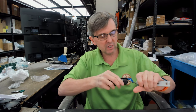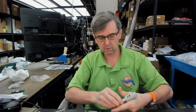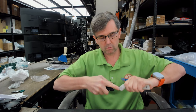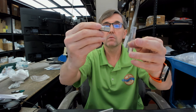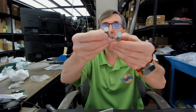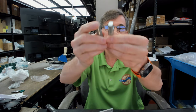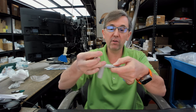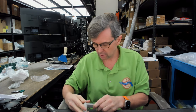You're going to receive with these two pins and four set screws, and a spring, actually. So, per the installation instructions, which we're going to go over, you get a short and a long pin. The part that's machined on both ends, that's the exposed part. The other end is not machined on both ends. Meaning that's the end machined on both sides, squared off. That's what's got to stick out of the hardware. That's how you'll know you've got it in the right orientation.